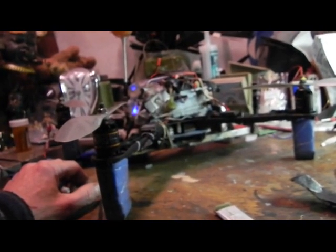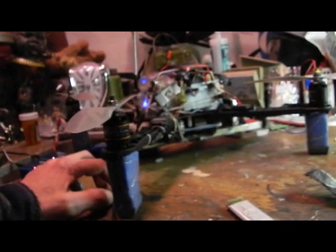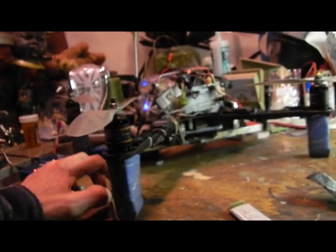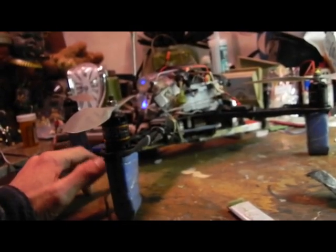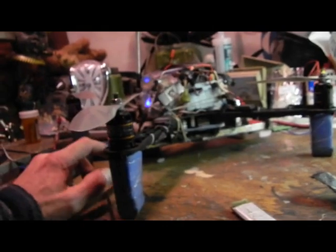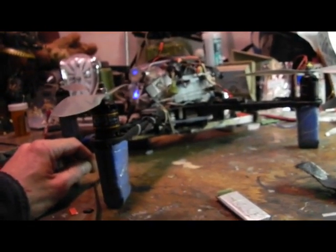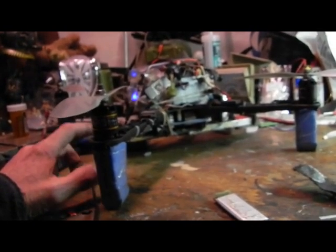If you're going to set your baro, or you're going to turn it on a Freeflight 1.3 board, make sure that you're up high enough that you can catch it if it starts falling because the baro's off. And it might be just because the baro has a piece of dust in it, or it's been jostled, or somebody moving around has put a finger over it and blocked the hole and stopped all air getting in there, and it recalibrated itself after, you know, a few hours maybe.